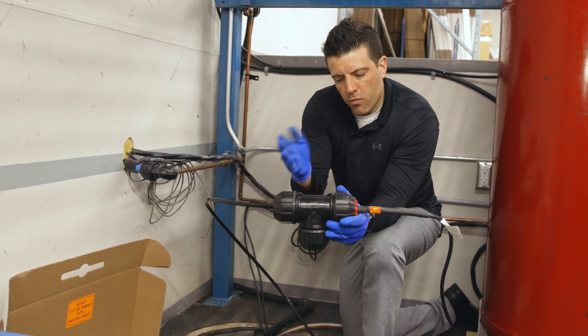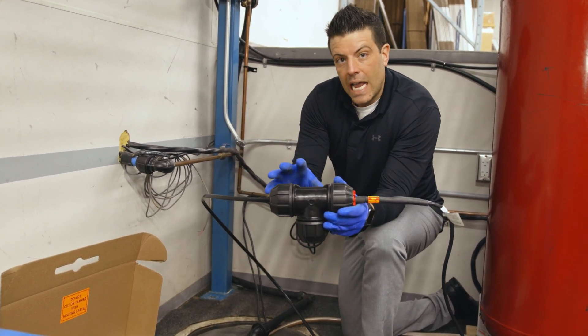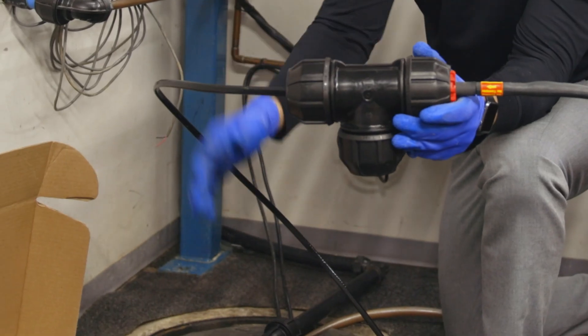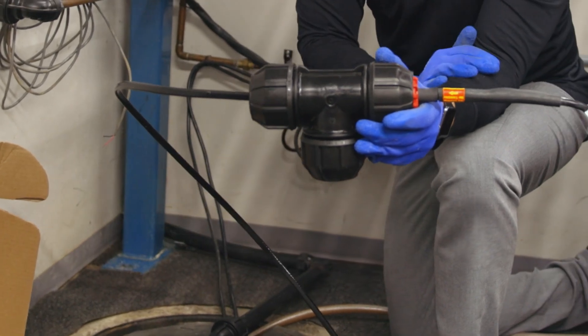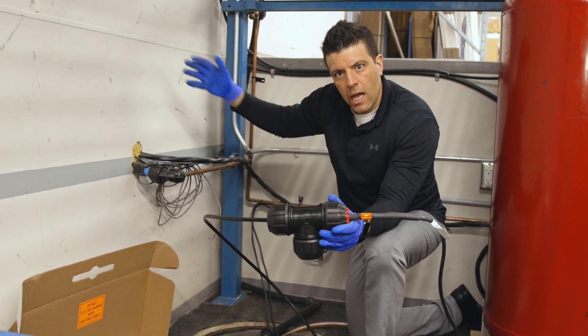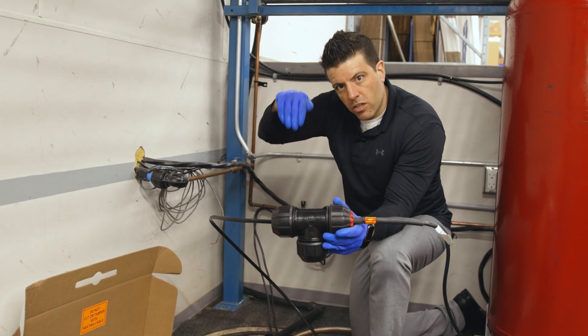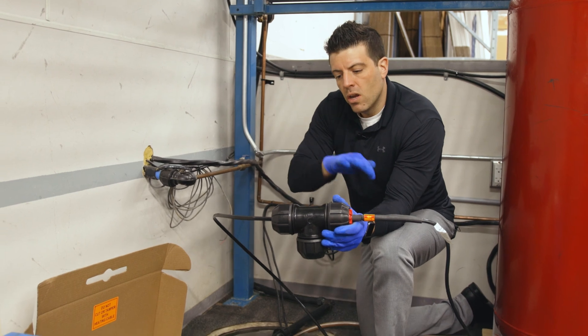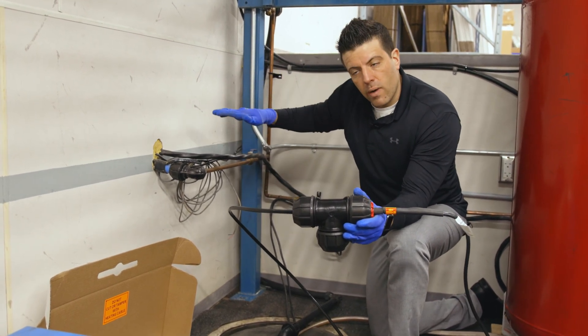A 90-degree RetroLine is something you need to request in advance. You'll also notice we've got a fairly short heating cable here, because some of the pipe is buried outside and the underground portion is deep enough that we only need to protect the first section of pipe to get it outside and underground.